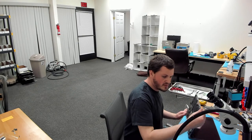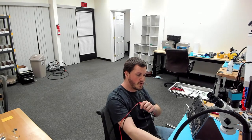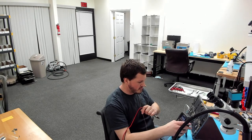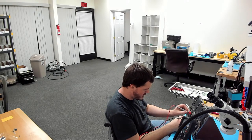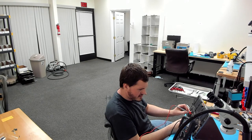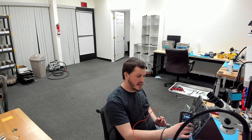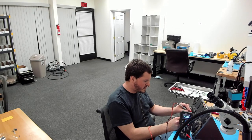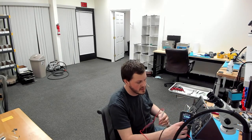One other trick that you can see if a board, one of these 1706s or 1708s or 1707s, is posting is you can grab your meter, voltage mode of course, and measure CPU V-core on the coils near the CPU. And if it's posting, we will get 0.7 volts contrary to 0.9 volts. So if you have 0.9 volts, the board is not posting. If you have 0.7 or 0.6, the board is actually posting and starting to boot.